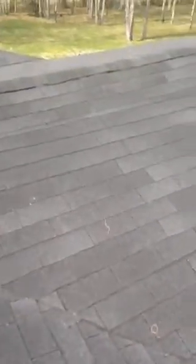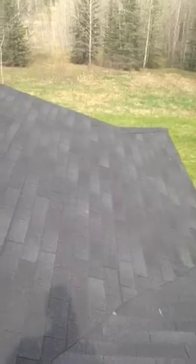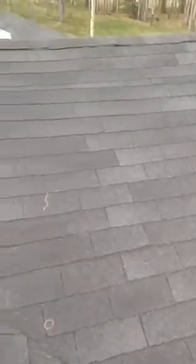This valley here is a bit weird. The lower side should have been the side running up and under, and then the higher side should have been running over top. But it's not — it's not a big deal, it just looks kind of weird the way it's cut. And there's no metal in there, so hopefully they did the underlayment good.